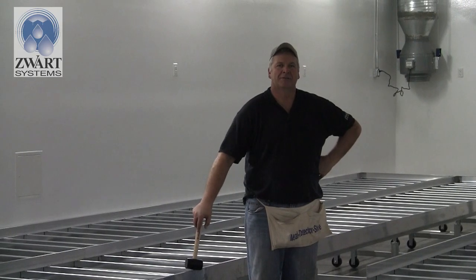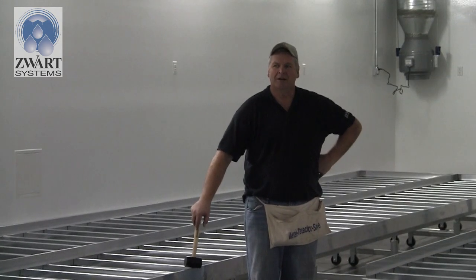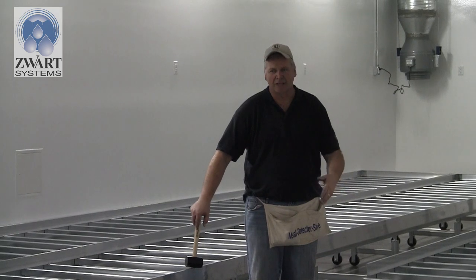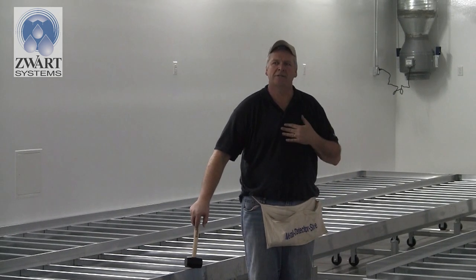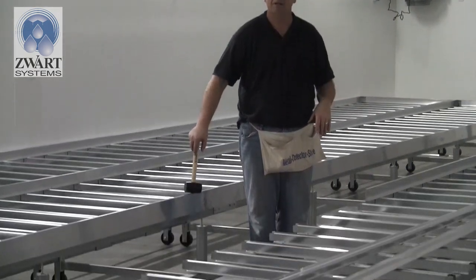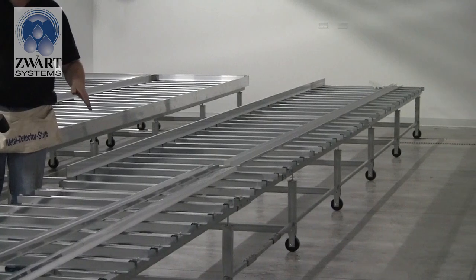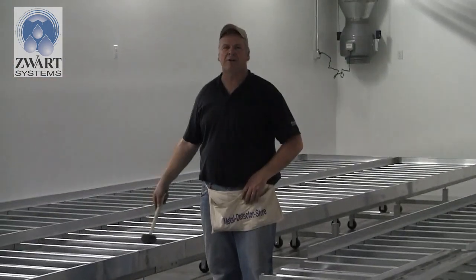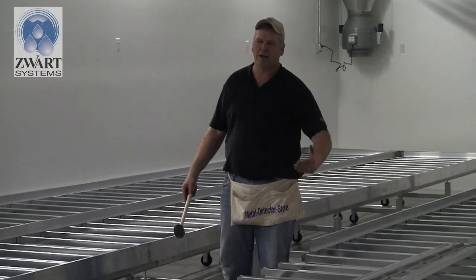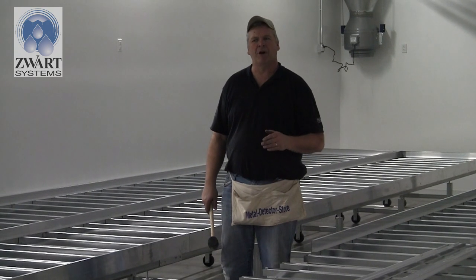Now putting on the side profile. We've been working nicely along this bench project — all cross members (called hat profiles) are spaced properly. We rolled the bench over to the adjacent bench to use it as a reference, keeping them straight. The important ones are on the drawing and must be in a specific location.